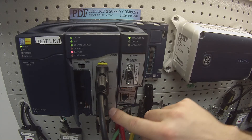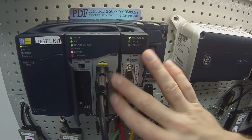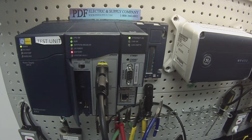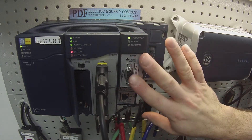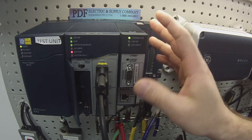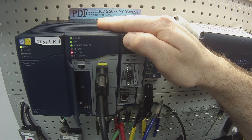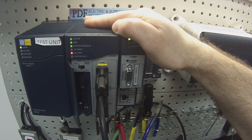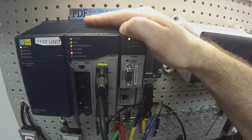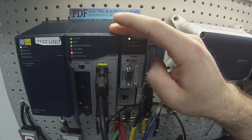The switch is working, the self-diagnostic is working, and I'm able to get the processor into run mode. If you feel this processor could be troubled, leave it in a rack as shown here — it's good to have a module to the right of it for heat retention. Leave it in run mode for two or three days, maybe over a weekend, to confirm the processor can retain itself in run mode without falling out or producing errors.